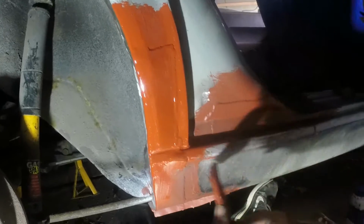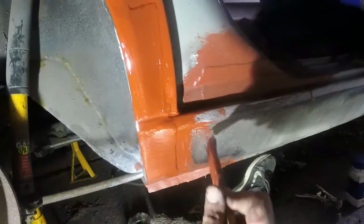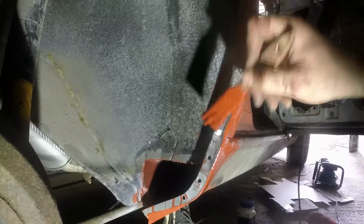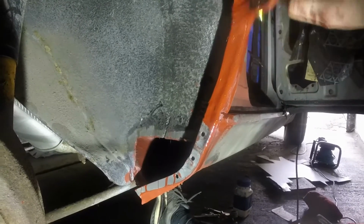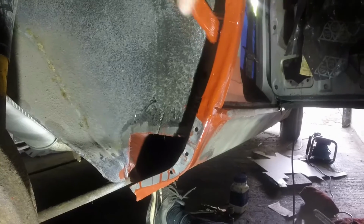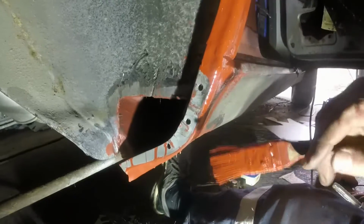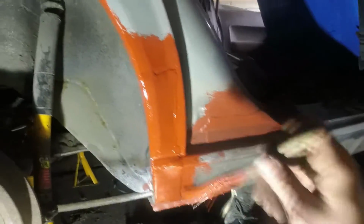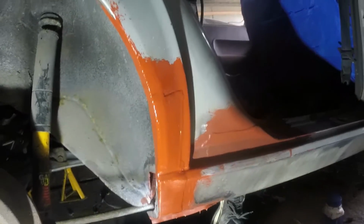Oh, that does look good. I'm really happy with that. I could build it up with filler and then grind into it and then seam seal through the filler and it'll look dead original, which is what we like. Incidentally, that did get spot plug welded, so we're all done down to about there. I'll do a final grind along that seam when this bit's done, and we should be winning. Super-duper. Yeah, that does look good. Never repaired one quite like that before, but that's becoming my new favorite technique.